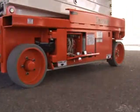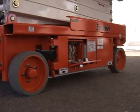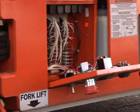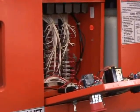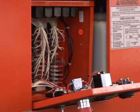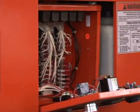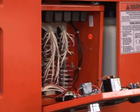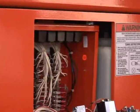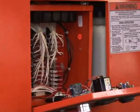We've heard from some competitors today that they've eliminated relays. We've tried to minimize ours—there are five Bosch-style relays in the lower control box. You can see a very well-decaled lower control box, with a number of termination points laminated to the back face. Very few components downstairs: toggle switches, a 10-amp fuse, an hour meter for accumulative run time, a motion alarm, and the emergency stop button downstairs.